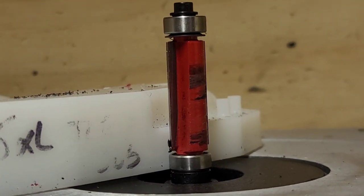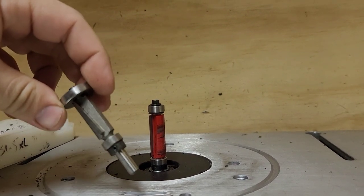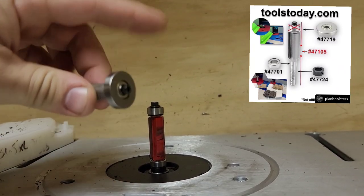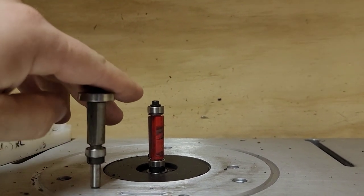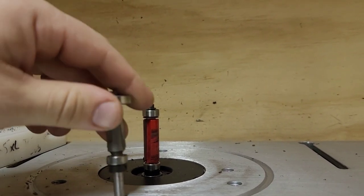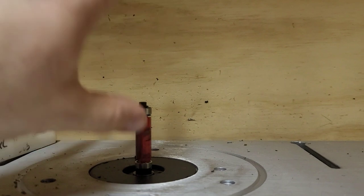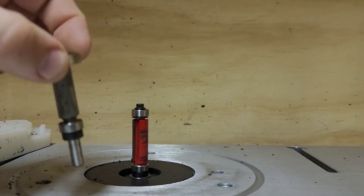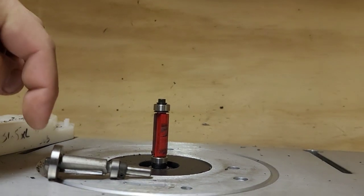You could go down lower or higher — it literally doesn't matter as long as the collet is not hitting the bottom of your trim jig, and same thing with the top. There's also a different bit you can use that looks like this. This larger bearing is for doing EDC trays. This is a flush bit cutter — flush means wherever the bearing touches, that's where it's cutting. You can get longer ones or shorter ones. This one works for me; I do have to adjust it on some holes but no big deal. Same thing here — you've got your locking ring, your bearing, your tool, and then the outer bearing which bolts on right there.